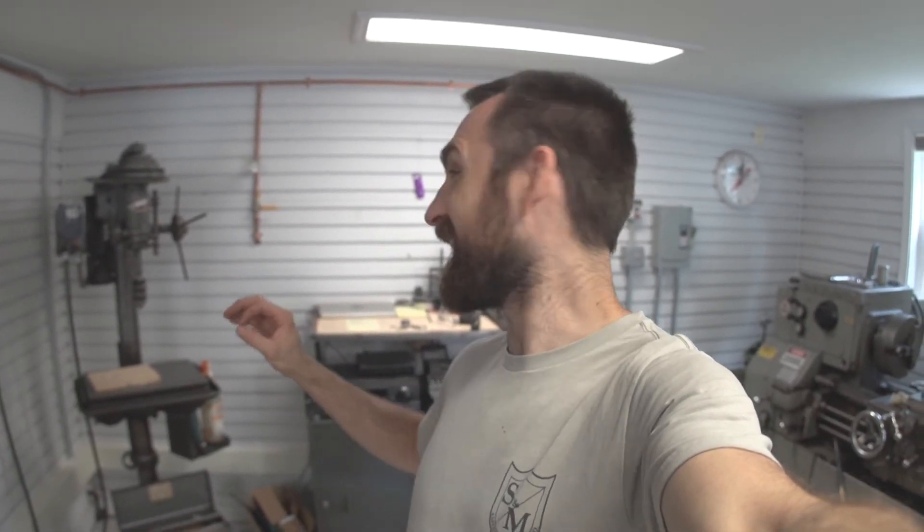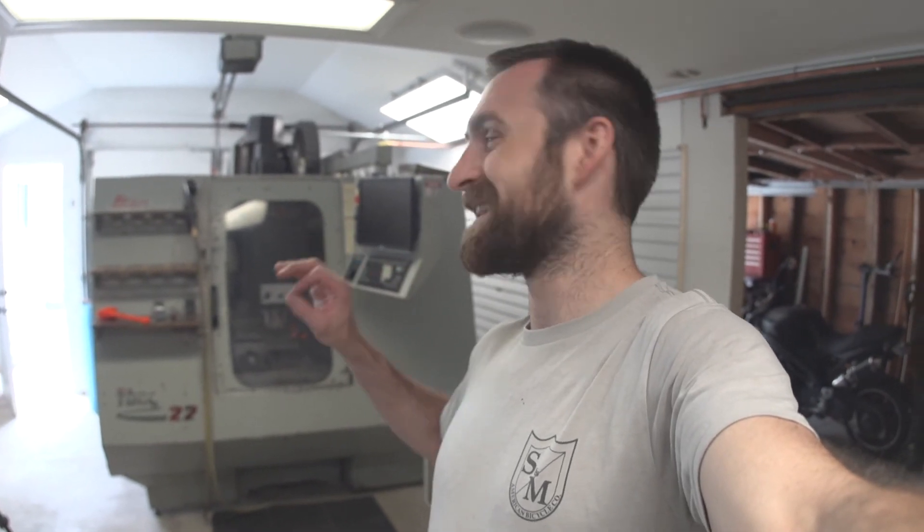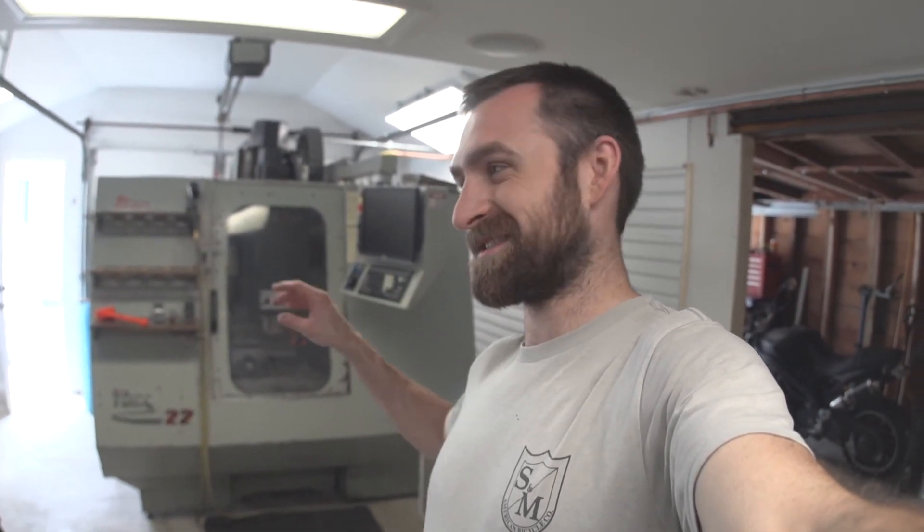Now I've got built-in shop air regulated to 90 psi. I've got a ball valve, a gauge I can look at, copper lines running everywhere — which looks beautiful, won't corrode, doesn't leak — and a quick disconnect at each station. It's been a big job getting my CNC mill here in the garage operational. This air system was the last piece of the puzzle, and it's finally here. This thing's fully operational, so next up is just to start making stuff. Stay tuned for that — thank you for watching.